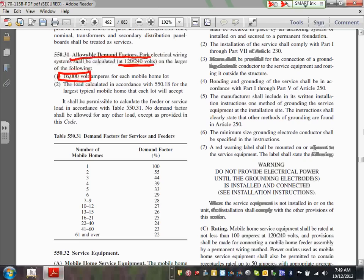By the way, Adam, my friend, your house and my house are allocated by Xcel Energy when they do the calculation. Well, they give us 10 kVA or 10 kW. So 16 kW is not something to sneeze at for a manufactured home or mobile home. On average, a typical house demand is 10 kW. Okay, now remember, everybody knows where the 16 came from?